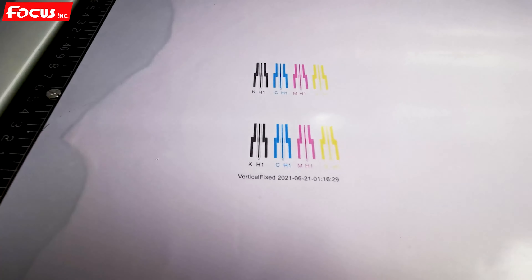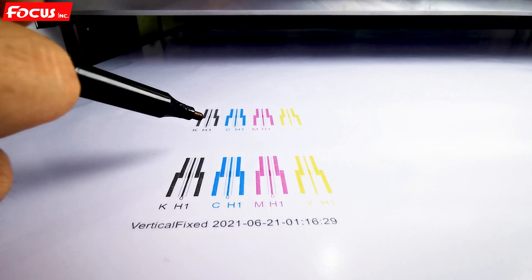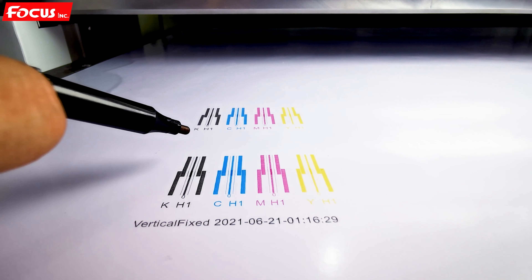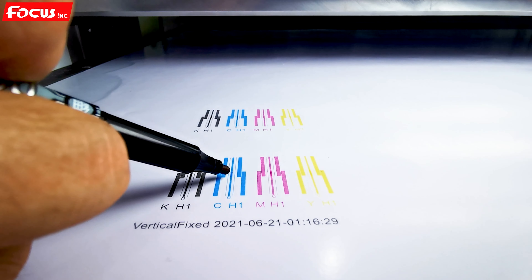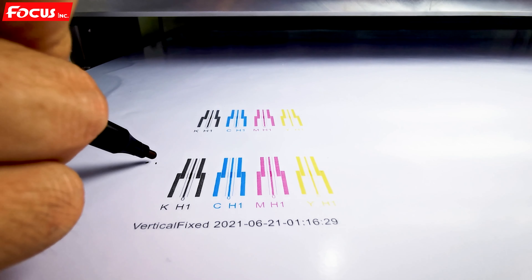After checking the print-out picture, we can see it is printed twice — by two passes. For the vertical calibration, we must check the middle three lines: one, two, three. The two outer lines should be smaller on both sides and one larger line in the middle. The lines must be straight and connected with each other — straight lines coming out.